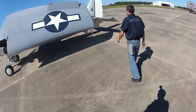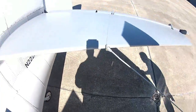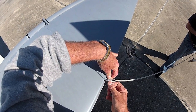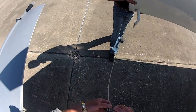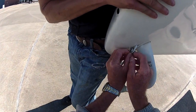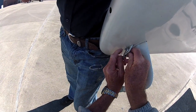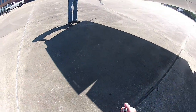We're going to get the wings out here with Brian. What has to happen is we take this nut off, he has to pull the wing up so the cable gets slack, we take this off, pull that pin, and then I pull this little pin right here. Then we let the wing go ahead and fall, so it'll just go down naturally to a certain point.